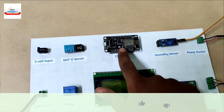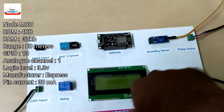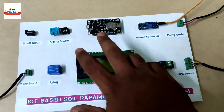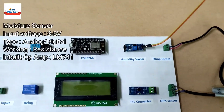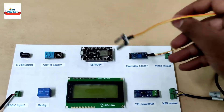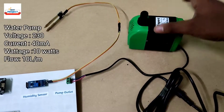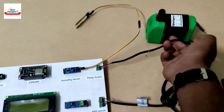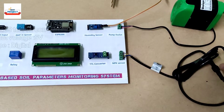The next component is the ESP8266, which is responsible for running the entire model — handling the LCD, managing sensor data, and all such things. We are also using one soil moisture sensor to measure the soil moisture level. There is a water pump connected here to feed water whenever the soil moisture level reduces to less than 30 percent, so the water pump will automatically turn on to fulfill the water needs of the plant.